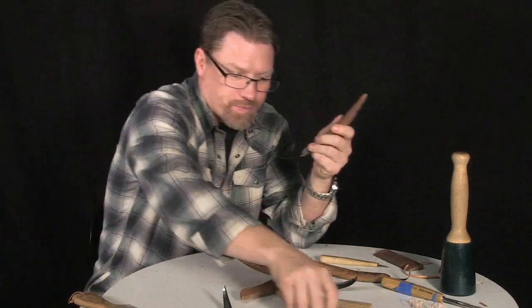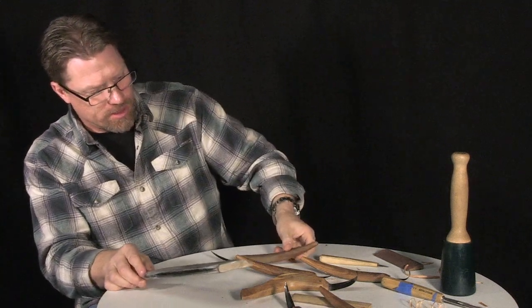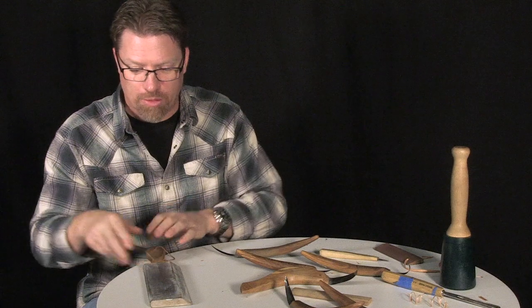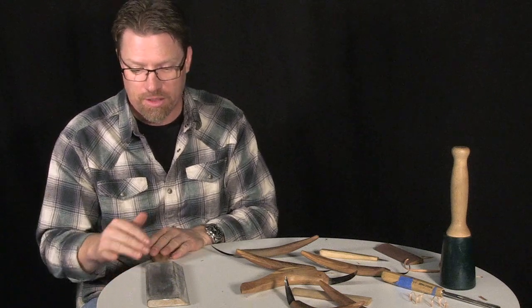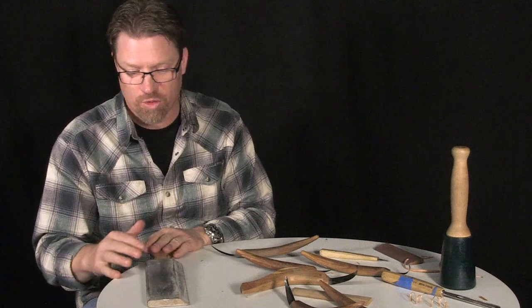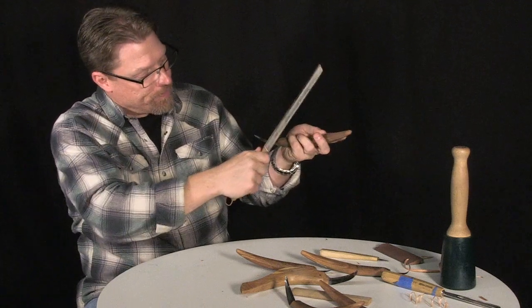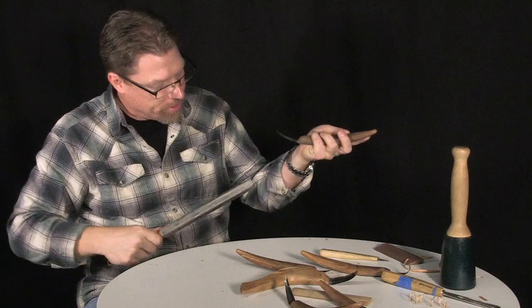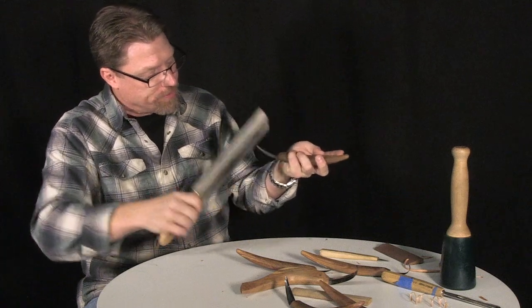And then the very last step is stropping or honing your knife. That can be done in several different ways. I've seen people put polishing compound on wood or some form of rubber. What I like to use is leather, and people use different sorts of very fine aluminum oxide, 2,000-4,000 grit pastes or powders, and they apply it to their leather strop. Then you're going to do exactly the same thing that you just did. You're going to follow that angle, and you're not going to drop the sharpening tool off the edge, because this will round it off as well. And this creates a mirror polished finish.